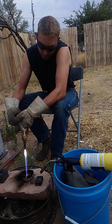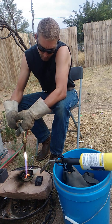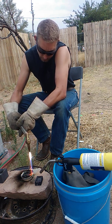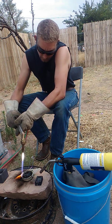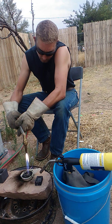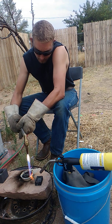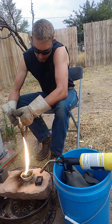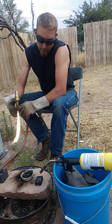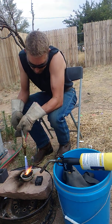I think I'm running low on acetylene, so we gotta make this quick. I'm actually gonna have to use more of an oxidizing flame. I'm gonna have to break this down, melt it real fast. We've got a whole bunch of carbon on it. I think I can burn it all off — need to work quickly. I'm almost out of acetylene gas. It's not gonna be quite hot enough, but let's just use an oxidizing flame and get it done.